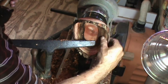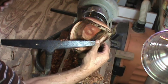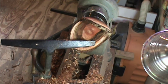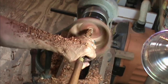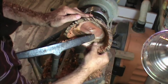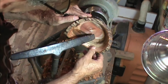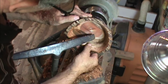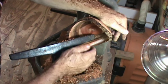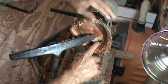That's pretty good, and it held up. I'm just going to clear up right about here a little bit, go a little bit deeper on this transition. This is pretty good all the way through. I got it a little bit thicker than I normally like to keep on bowls — about three-eighths of an inch thick. Generally I like keeping these things a little bit thinner than that, but I saw this void and was a little worried about being able to keep it with the way it is.